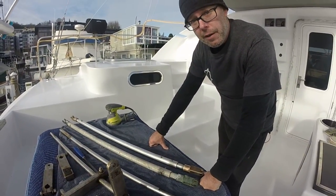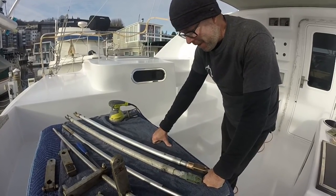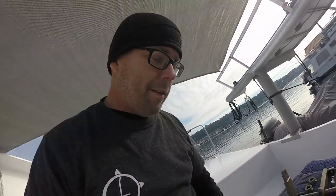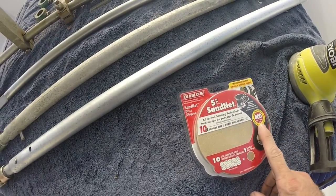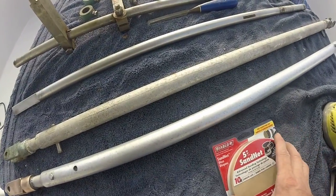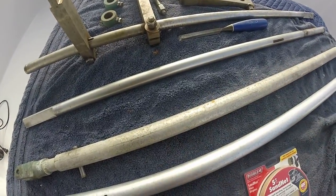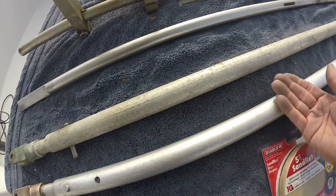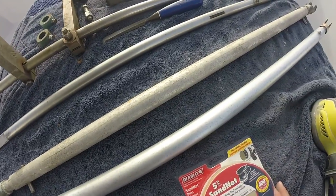Do you want me to help you? Well, yeah — you got some time? I got some time before we have to get ready. Love it, come on. Okay, here's what I've got going. I'm working all these surfaces over with a 400 grit, then I'm going to work it up to 600 grit, and then polish it out. This 400 knocks down all the corrosion nicely — it is just a world of difference. It actually knocks it down pretty quick too.